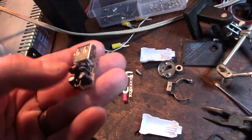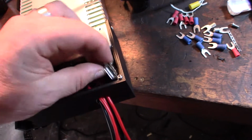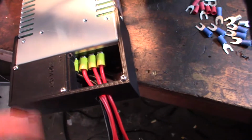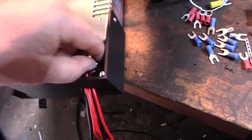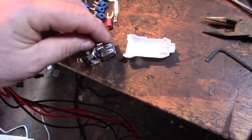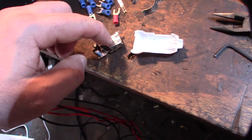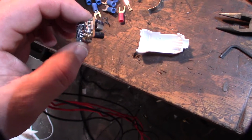You can see the little coil converter in there. And I'm going to mount it somewhere, I think, in here. I'm going to glue it onto that board. So I have to take this cover back off again. Kind of sucks, but desolder this. The ground is the outside here, and there's a clip on there like that. So I'm going to solder ground here, and this is the actual positive contact right there in the center.